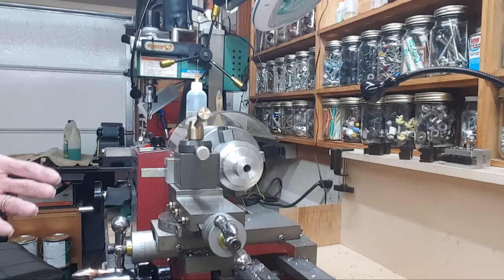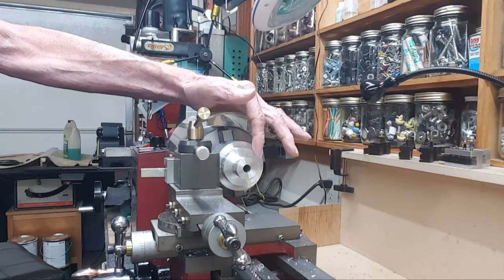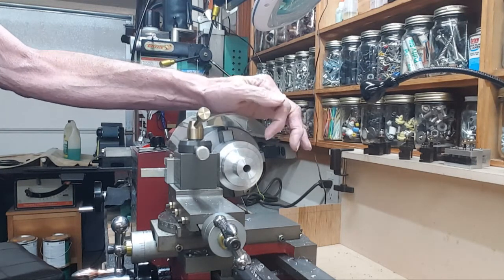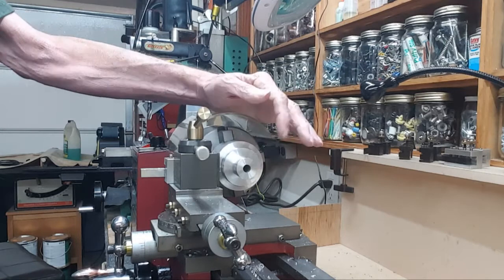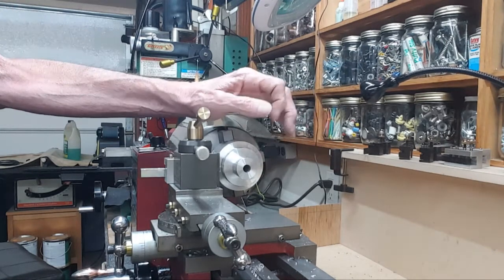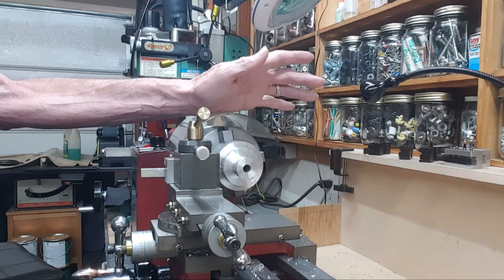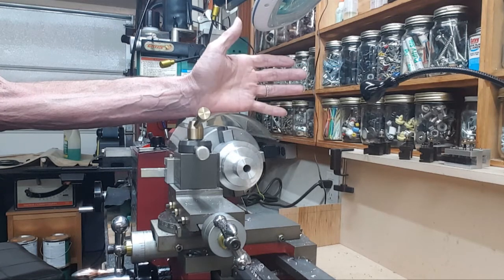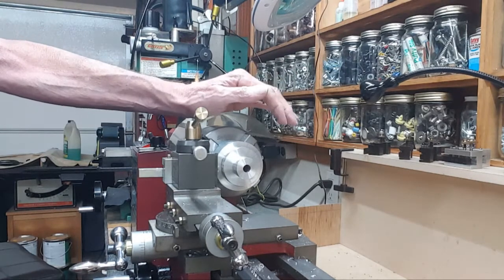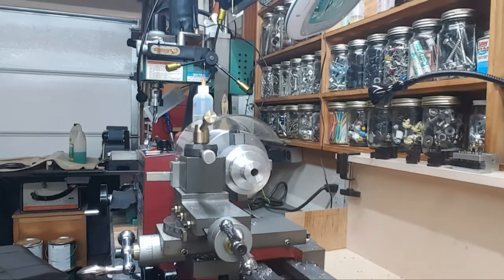This is what I have so far — that's turned to diameter, it's ready for the threading. I've got my relief back here and I decided to just start drilling it out all the way through. Next step up would be a half-inch bit and then bore it out to 600 thou per print. Not too much more to say — pretty cool, I really like how it looks so far.